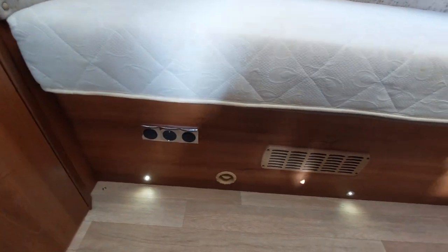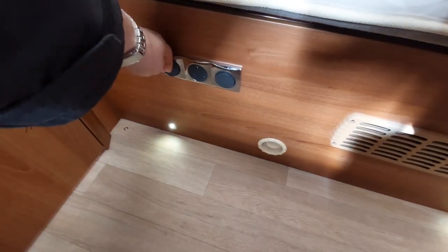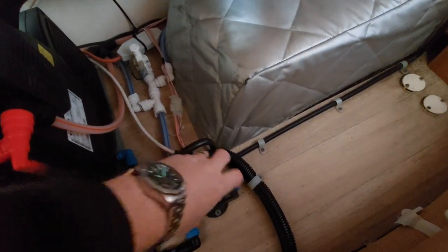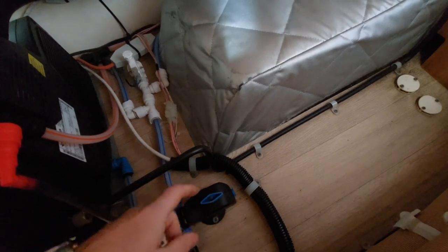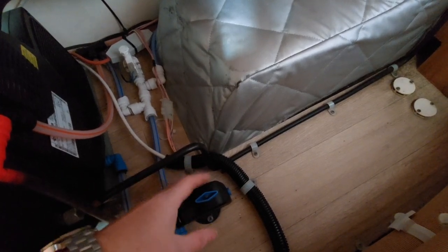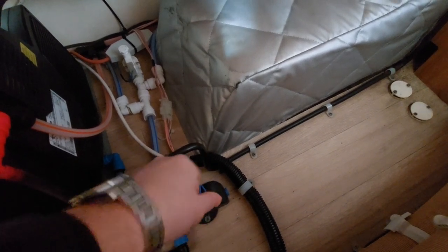Finally, in the bedroom we've got your power sockets underneath with separate light switches for the bottom lights, and you've got the same on the opposite side. Underneath this bed we have your drain point for your water boiler — it's very important that you drain this off for the winter. This is your frost protection valve, currently in the open position. To close it, twist and push — you've got that blue part on there so you're doing two operations. When you close it in the winter it should open automatically, but as a matter of course you should protect it by doing that procedure.